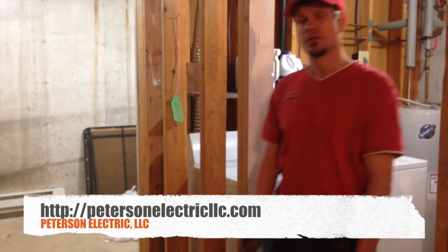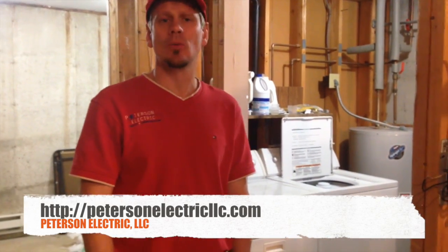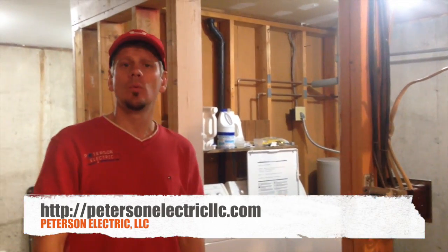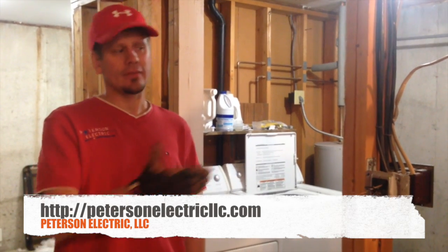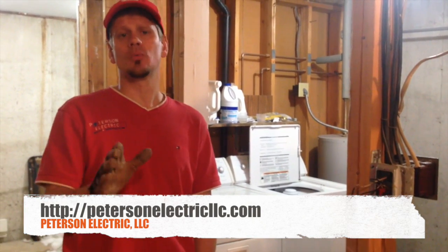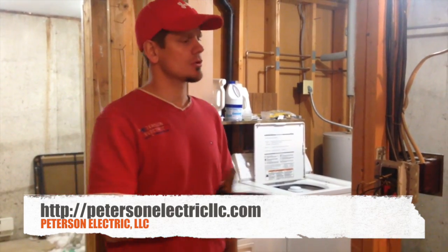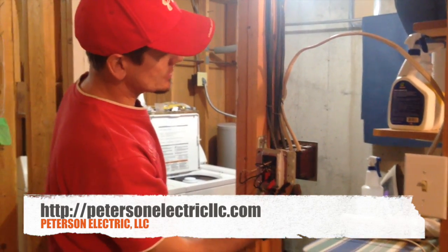The danger of that is that you could get killed fairly quickly. So when people say, Joshua, I don't have any grounds in my outlets and my lights and my switches, what do I do? Well, Article 250.22 talks about grounding. You can either A) rewire your house, or B) possibly add some grounding that would help your outlets with some wire mold surface mounted on the drywall. But basically the best way to do this is to rewire your home, which would be pulling drywall, getting your permit, making sure that all your branch circuits are completely rewired.